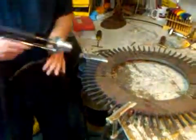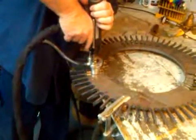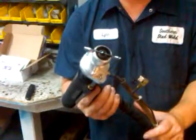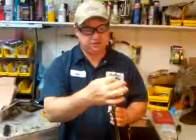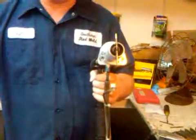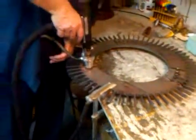Let's do one more. Basically we just made a stud holder that holds this piece of material. Then we have this gas shroud — we use a shielding gas to evacuate the atmosphere from around the weld. It's really fast and really easy.